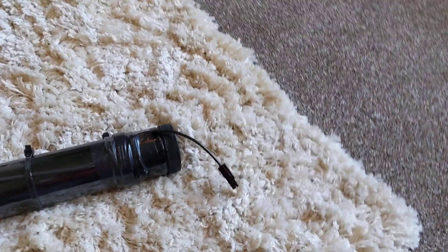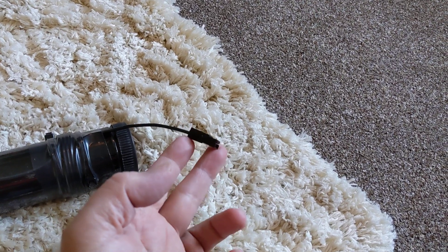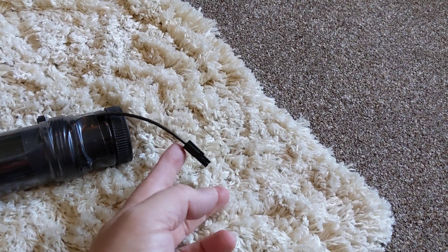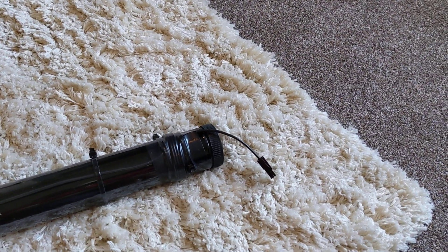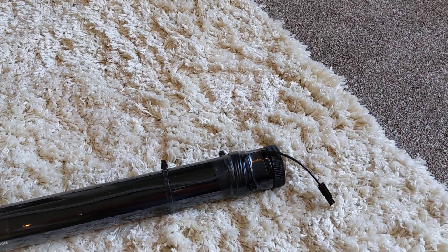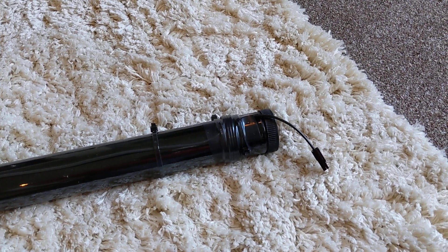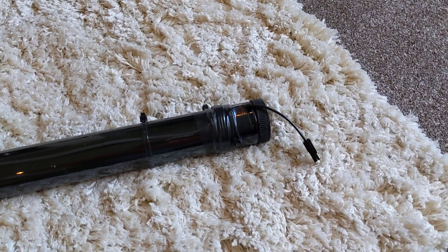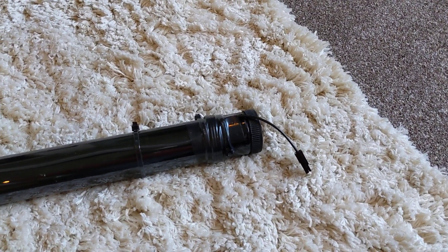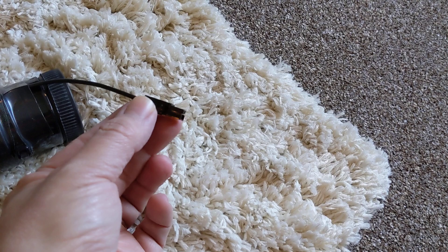What will happen is that I will carry this with me, and I will take a couple of elements that will plug in here. One will be for 20 metres, and one will be probably for 17. And I might even do one for 30 metres, because although this is a 10-metre pole, when I've used it as a half-wave in the past, because of the inductance in the transformer, you end up with probably about 8 to 8.5 metres on 20 metres. So a 30-metre half-wave is going to be longer than the pole, but not much longer — you can actually just use it like a guy and attach a string to it. And I'm going to color-code them, using different colored Powerpole connectors so I can tell which is which.